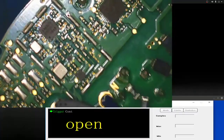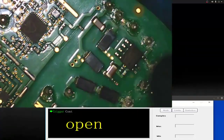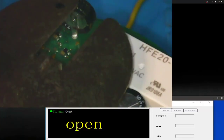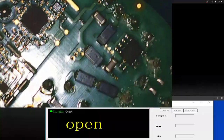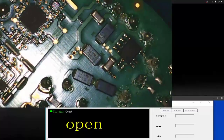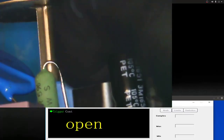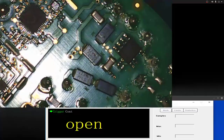Yeah, so as we've noted, this is our switching power supply. Basically, the voltage is regulated down, it's rectified down, and it just goes off into the board. And on the other side of the board, there's nothing really, some resistors, bits and pieces, there's an inductor. But yeah, that's how we get our voltage down. And there'll be little tiny voltage regulators, but those voltage regulators will just be taking like 6 volts down. Can you see it there? Hang on, where are you? Yes, there's a little coil just there as well. That's part of the rectification. That's directly below our switching power supply, so that'll be involved in taking the voltage down as well. Yeah, it's as simple as that.